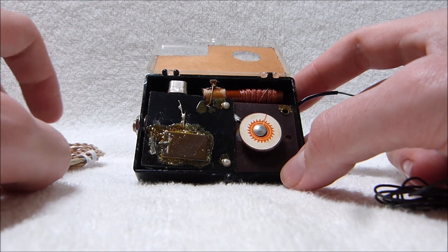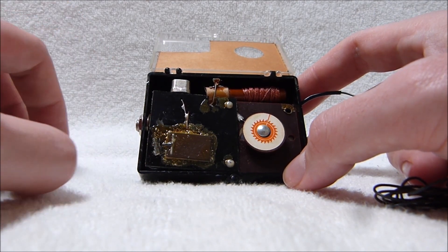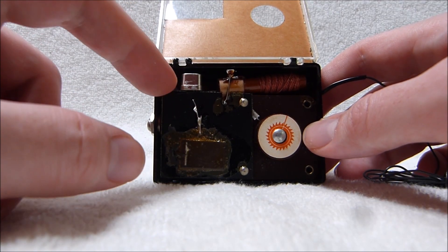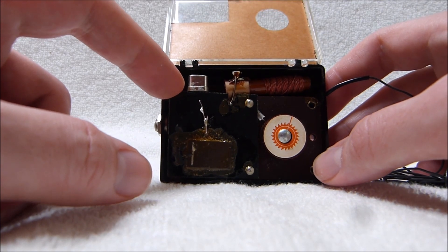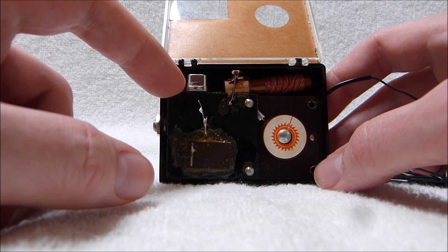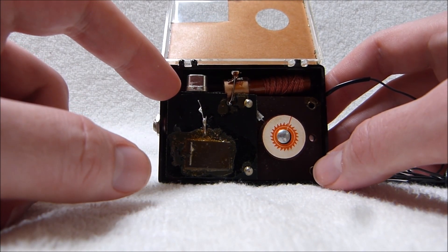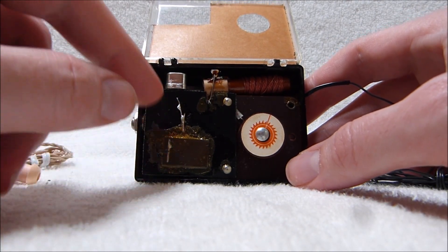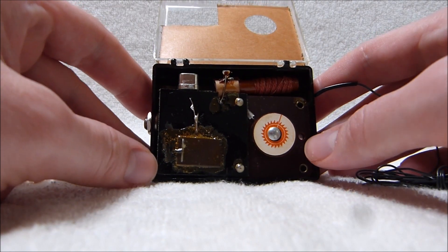I love demonstrating these things, but unfortunately as it stands now, the output of this thing is so low that I can barely hear it and the camera would just not be able to pick it up. The transistor they used, for cost reasons, is a so-called fallout transistor — one that was rejected from the production line for failing to meet minimum specifications. It's not marked with a maker or part number, but from the case style I can tell it's a Texas Instruments transistor. I measured it with my multimeter on the diode test function and it is very nearly shorted. I am considering disconnecting it and installing a little transistor socket so I can plug in a replacement transistor, but I may just leave this thing be.